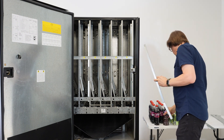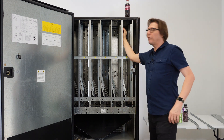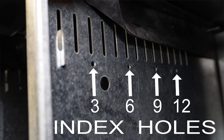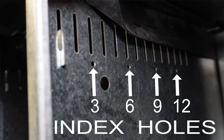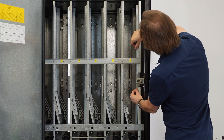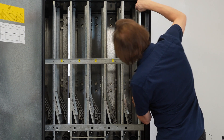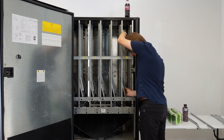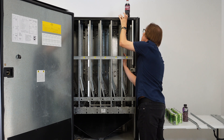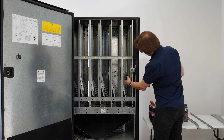To make the adjustments for the 16.9 ounce bottle, down the walls there are actually notches and a counting hole or index hole that's always three back. So if you know where your first index hole is, that's three back; the next index hole is six. To adjust the spacers, you just lift up and move them back to lock them in. I'm going to go back to setting seven on both sides. With the bottle in place, it should fit right there at the cap — perfect.